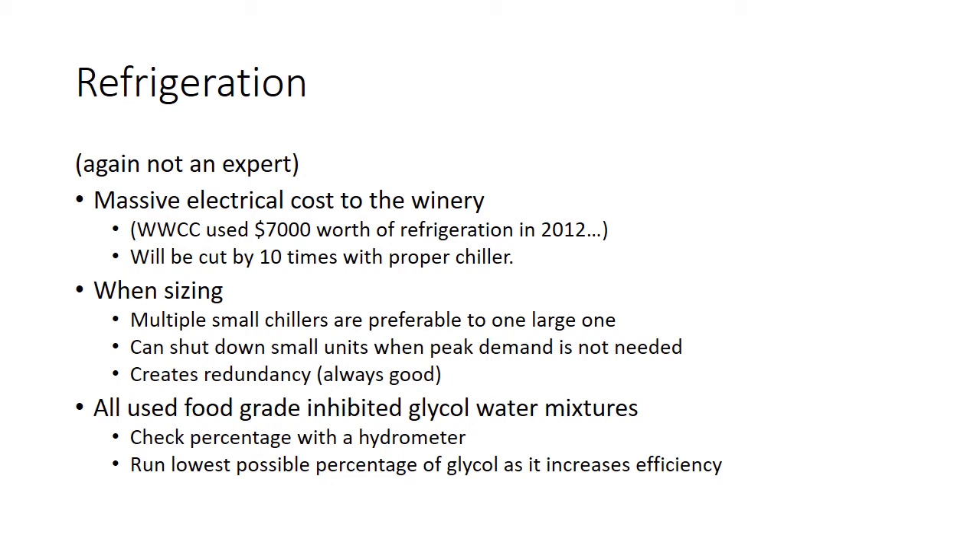In 2012, we used $7,000 worth of refrigeration because we had the wrong chiller. They changed the chillers and put in one that would have reduced the cost tenfold down to about $700 a year. The only problem was they put the chiller under the canopy — it got so hot it drew more power. Hilariously, this was done by our HVAC team that teaches HVAC at the school, and the first page of the owner's manual says 'do not install under anything.' They immediately installed it under something. After it burned out, the new grounds team put in a giant chiller that's going to draw about $20,000 worth of electricity a year.